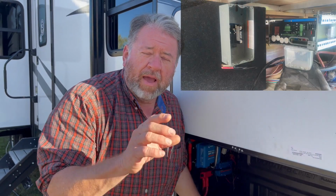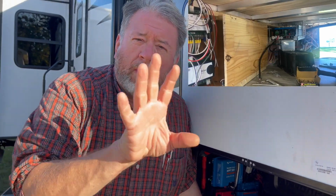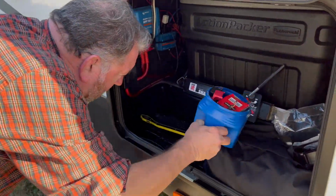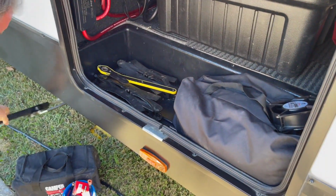We didn't really get as complete a video on this as we wanted to for you, but we already did a video on the other system that we did, and it had smaller wires in it. We weren't happy with it because the wires were getting a little bit warm. So basically all we did here is relocate everything and make it look more streamlined. It looks better, and we also put in larger wire, I think it's 4/0, is that right, Jeremy? That was double-aught wire, I'm sorry. It's a bigger wire, and now the system's working better, and we added a battery and moved the batteries themselves into the floor. We're going to show you that, so it'll take just a minute to get all this stuff moved out. But let me get it pulled out here right quick, because I want you to see the whole thing of what we did.